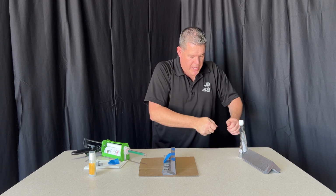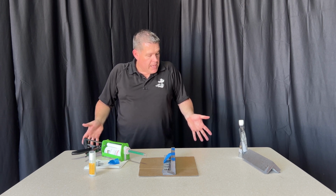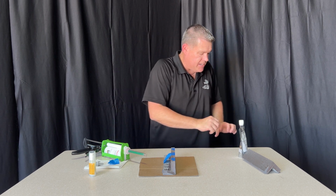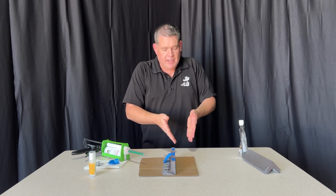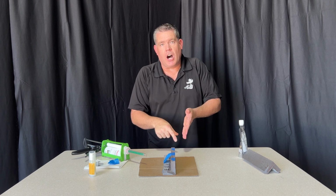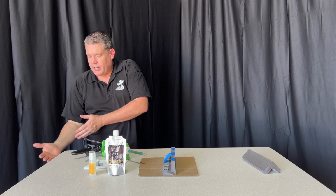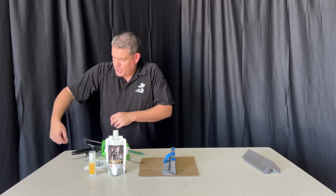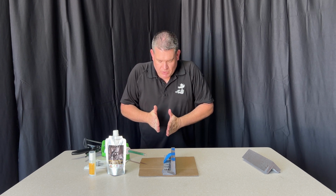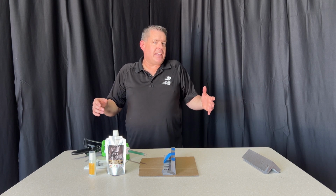So you are starting to spread out your adhesive here on this edge. You get down here, and you're going to fold up this miter. You fold it up, you're taping it, taping it, taping it. Let's say you wasted even 2 or 3 minutes taping up this one. That resin is kicking. Now you're moving over to this corner, putting your adhesive on it, spreading it, folding it up, taping it. You're buttering the corner. Even if you're working with 2 guys, from the time you start here to the time you get around even a small countertop like this, it could be 8 to 10 minutes.